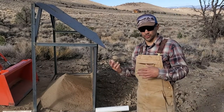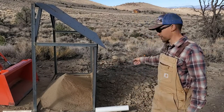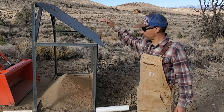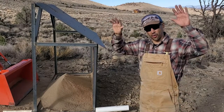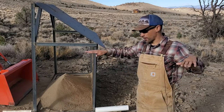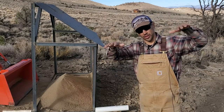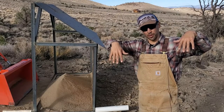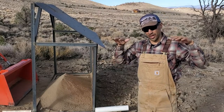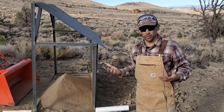Something I learned just from running this thing — this was basically three bucket loads. I built it and looked up the specs for my LA 525 loader to see how high it would get at maximum dump, and it was somewhere around six feet or so. But the ground around me isn't too level, so I gave myself a few inches. When I come up with the loader I tilt a little bit, and when I open the bucket all the way I can bang the top of the frame. So if you have that kind of tight margin, don't have your most inexperienced operator doing this — they might just taco the whole thing.